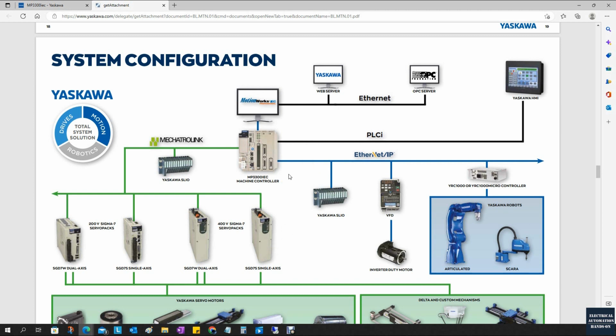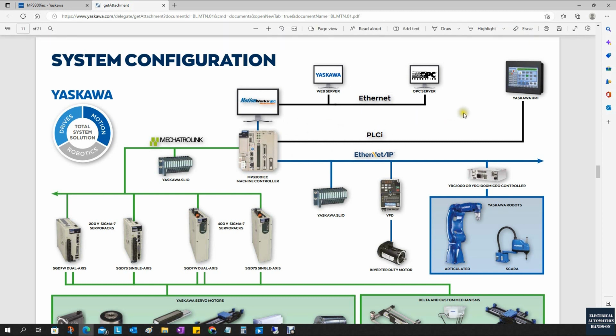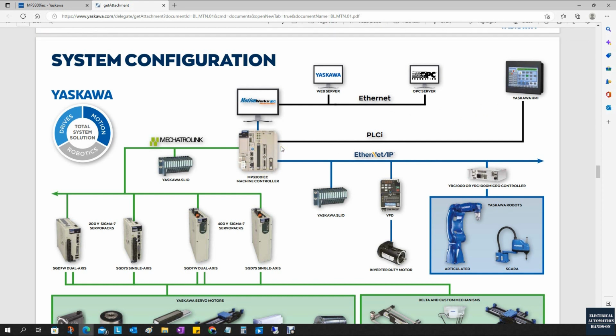But in some cases, the safety control may be a little bit complex, so using relays only is a little hard to implement. That's why, when we have a motion control system, we can use the Allen Bradley safety controller or the Siemens safety controller as the PLC logic-wise safety control, and this YASKAWA MP3300 can focus on the motion control.